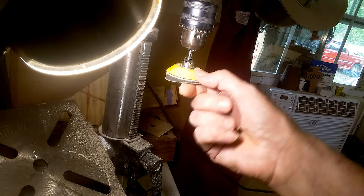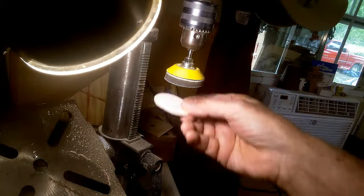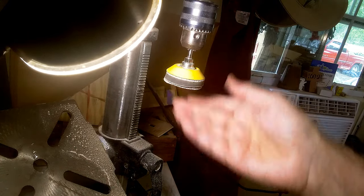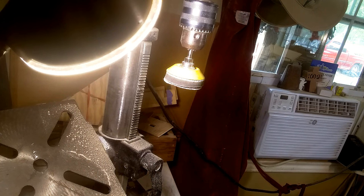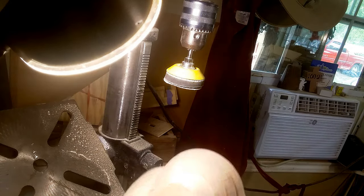It's also Velcro. I've got some more of these, and I've got a whole box of different grits. But I use that the most. Thing is, it really leaves some deep scratches. It takes a little work to get it out, but it's very aggressive and gets the board matched up pretty quickly. So we'll start working on that with a 60 and get these rings all matched up,